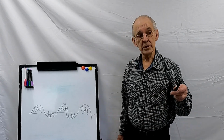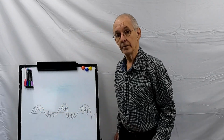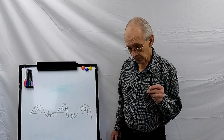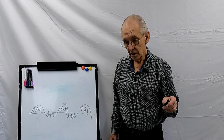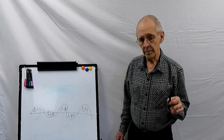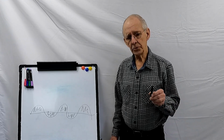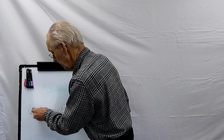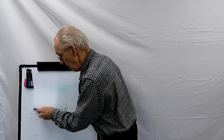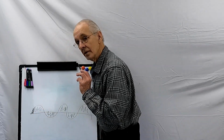So the energy released in a fault is all of that energy under the curve there, okay? So we also have what are called peak limiting fuses. And the way that a peak limiting fuse works is that it is able to trip so fast that it will limit the current on the way up the curve. And so now the energy under the curve is just this little tiny piece.